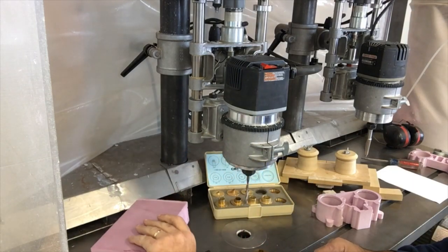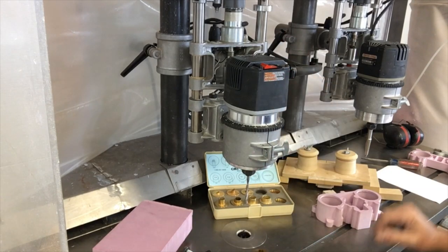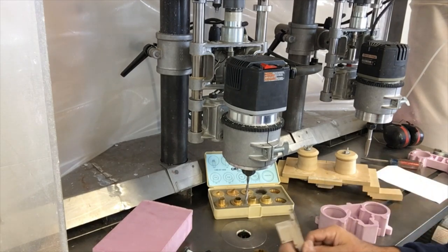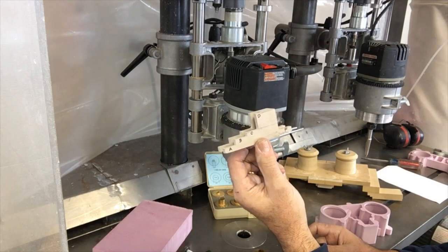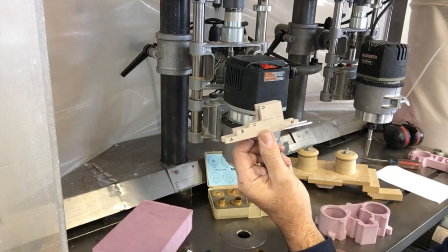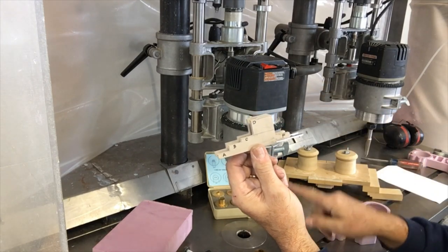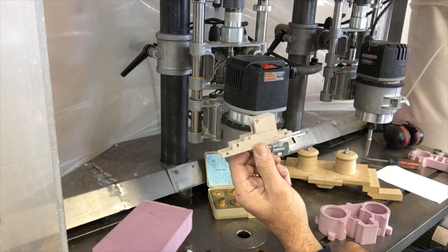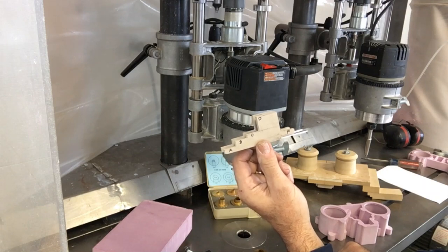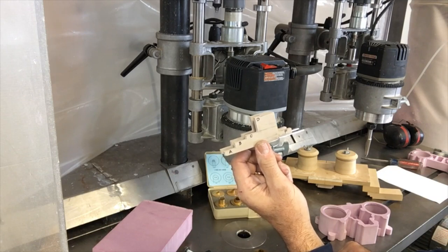And then I'll also have to show you a close-up probably of the pin and the depth stop mechanism, because there's a depth stop mechanism that I use on more complicated patterns, and I call it a key. What this does is that I make myself a little work instruction, because there's all kinds of different combinations of cutting height and pin height, depending on where on the pattern and the guide I'm cutting on. And it gets kind of confusing. So on more complicated parts like this carburetor main well casting, there's, I think, like 8 different combinations of pin position